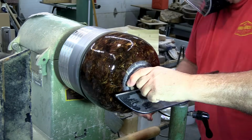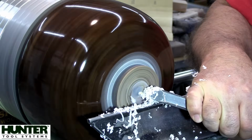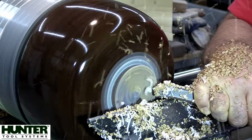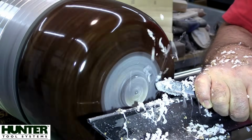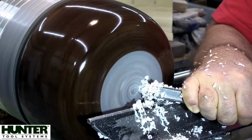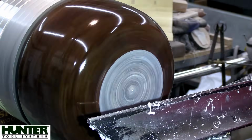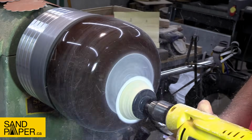This is the next day and we're mounted on the vacuum chuck, and I do have the complete vacuum chucking system from One Way Manufacturing. And if you do any amount of bowls or work like this, I really, highly, strongly recommend getting one. It will speed up your production, and it doesn't leave any marks on the surface of the things you're working on. If you do find that you're having marks left behind, then maybe the finish you're working isn't 100% cured, or there may be stuff embedded in the neoprene seal, so you might want to change it.